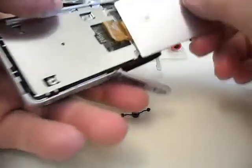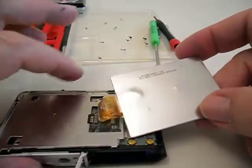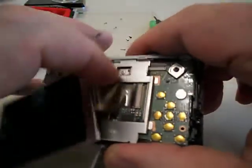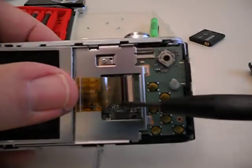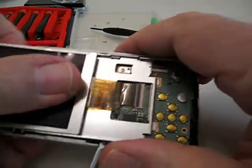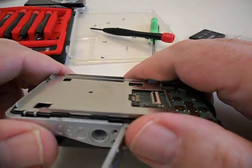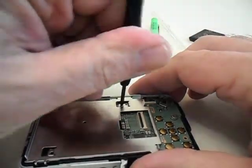Alright, here's your LCD screen — this is the main bottom one. See how it's all banged up? For whatever reason, somebody hit this thing a lot. There's a little bar up in here — you can see what they call the ribbon connector. Right here is a little black bar; with your fingernail, pop that up — that's all you've got to do. One little pop and that just pulls out. That's the bad one. You can see right here where it's pretty well dinged up too.